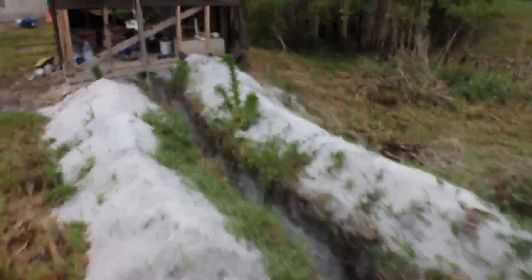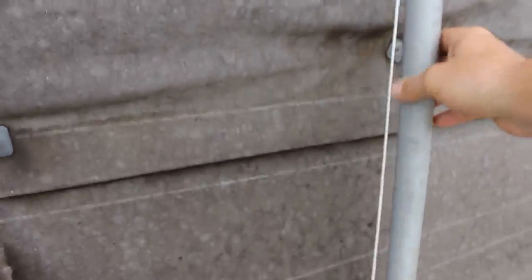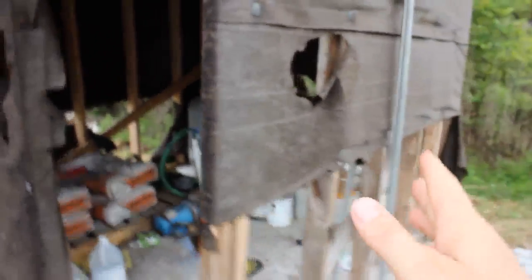The pipes have to be at least 18 inches underground. If you go down to 24 inches, you don't need conduit, but I wanted to use conduit to protect my wires. This is the one-inch PVC with a pull cord. I'll use that later when I'm ready to hook up power to the farm office — I'll dig a trench and pull in the wire. I'm going to install a door and siding here so everything is protected inside.